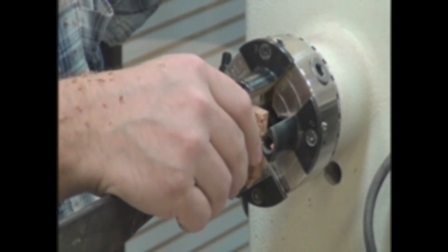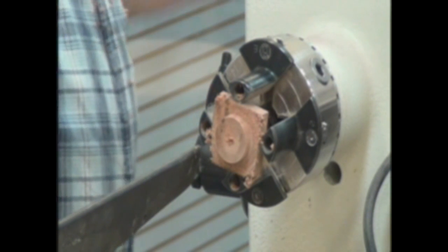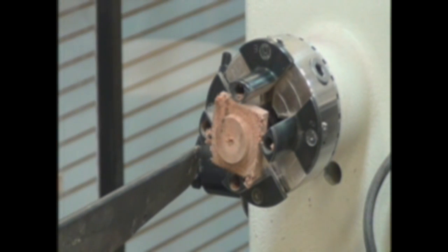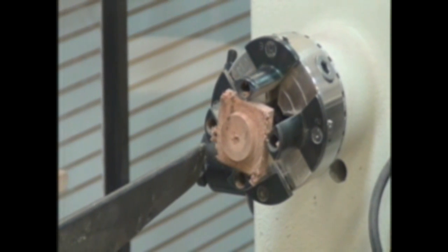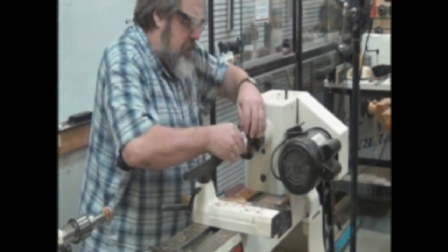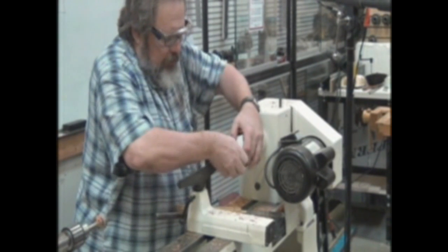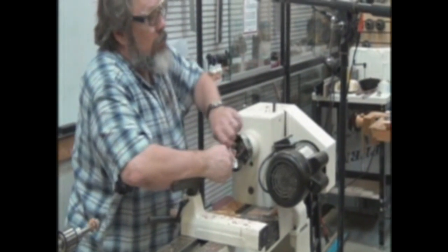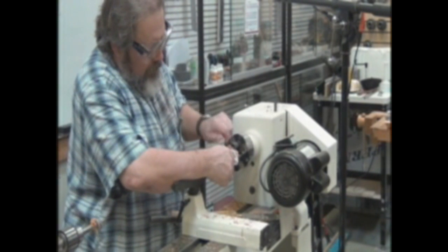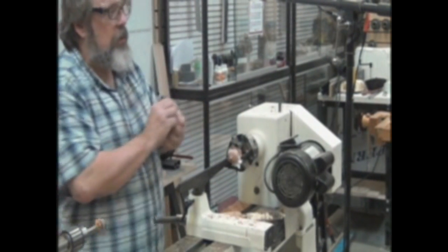I'm really surprised — does anybody have a towel? I'll take a Kleenex. This isn't really critical because all you're going to do is sand up the top a little bit and then knurl — all the energy for the knurling is going this way, so that's not a problem. When we do the nut and jam chuck that one, you've got to make it tight.